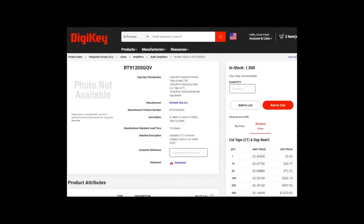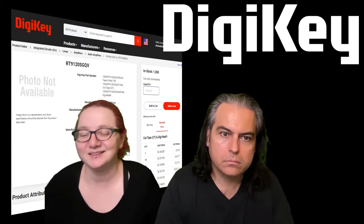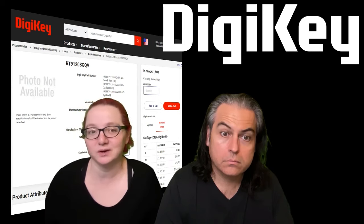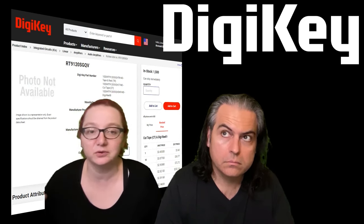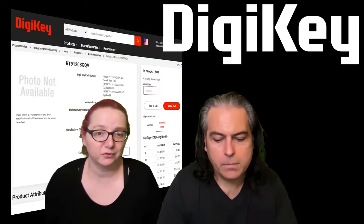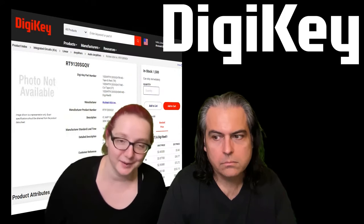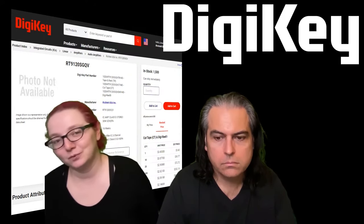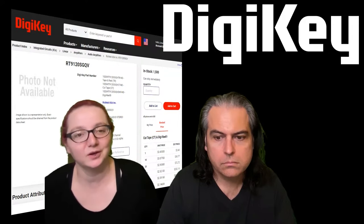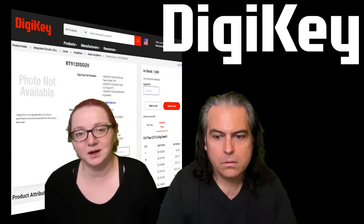Nice looking eval board, also in stock, available on DigiKey. And the price is nice. It's like $2 to $3 in quantity: $3 for small, $2 for large quantity. That's a pretty good deal for a stereo I2S, no M clock needed, 30 watts or 50 watts mono stereo I2S amplifier. So a nice chip, Class D. Check it out if you need a big honking stereo system.